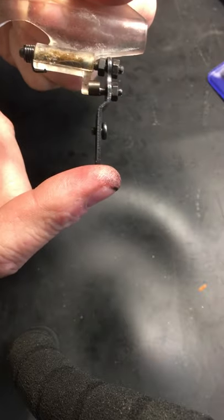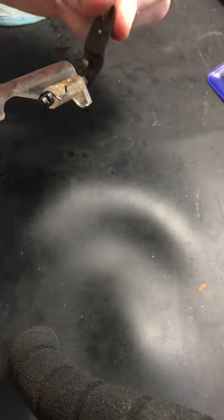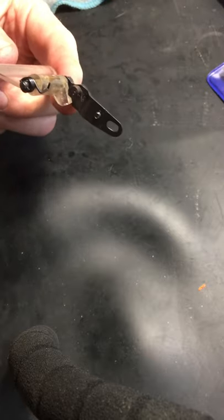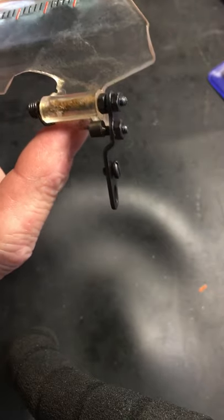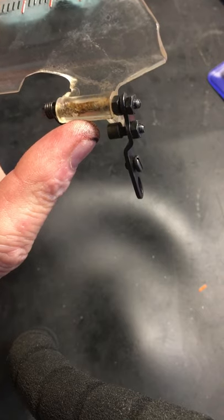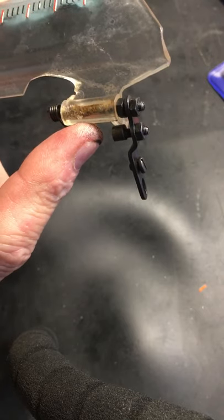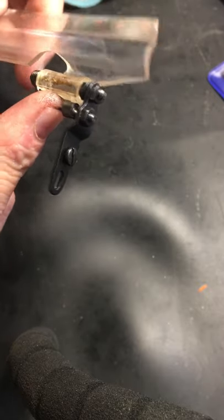On the end here there's this little plastic piece. Here's a side view — it's got this stopper, it's an eccentric stopper. It's kind of like an oval shape, an egg shape. It's got a jam nut and then it's got a flathead so you can adjust it. That way if it's rubbing on the platen you can just give it a little bit of a turn and it'll do this on you — that way you can clear the platen so it won't be pressed up against there all the time. It's a pretty easy adjustment.